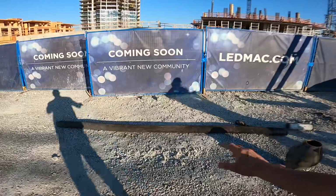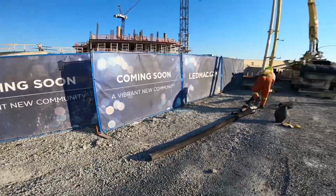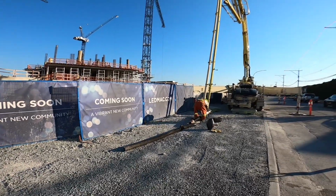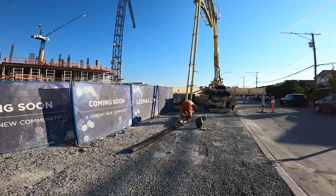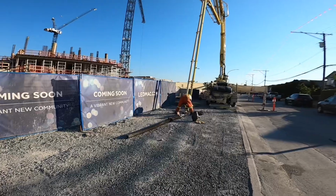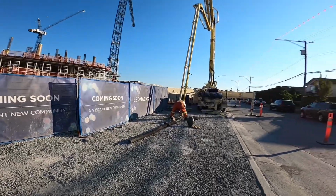And then we are effectively pouring through a single-ended hose, and we're not running the risks that are associated with running a double-ended hose, hitting an air pocket, catching a plug, whatever it may be, and the hose guy taking the metal coupling to the head. Deadly, deadly stuff. So anyhow, we're gonna mitigate that today.